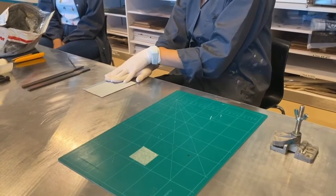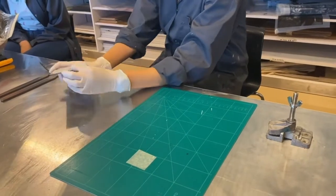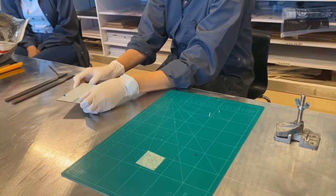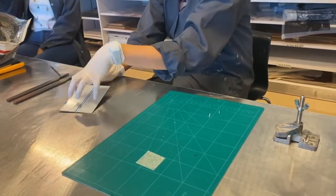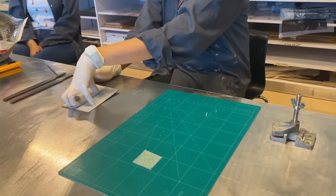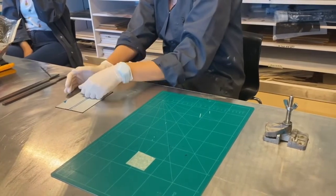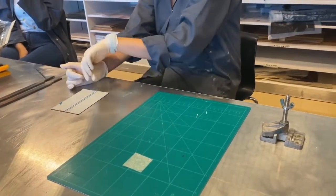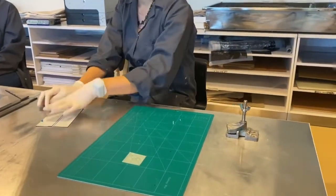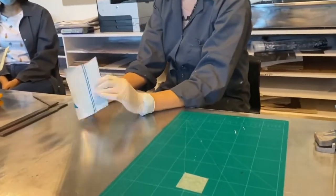Today I'm going to teach you how to do copper plate etching. These are copper plates and we're going to use a chemical called ferric chloride to chemically etch it. We're going to use stuff called big ground, which is a non-toxic version of hard ground. In the past I've done a more toxic version that requires paint thinner, but this one doesn't, so it's more safe for everybody.